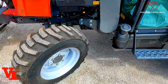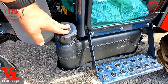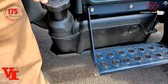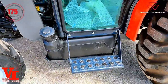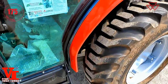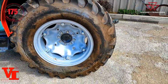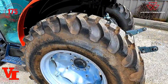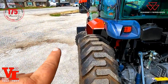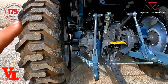One of the most discussed but often overlooked features is the ground-level fueling — basically about three feet off the ground is all you have to reach. You're not going to pour fuel all over the top of your hood or the back of your tractor. This features metal fenders and the R4 tire — 14.9x24 rear. There are available options including a 17.5 wider tire. This one fits real nice with the bucket, lining up the bucket edge to cut out your tracks.